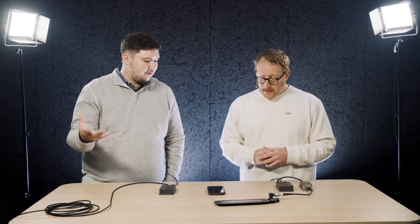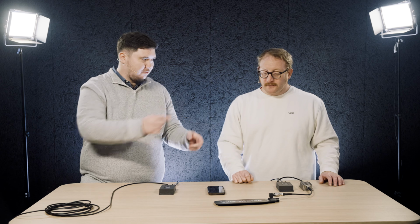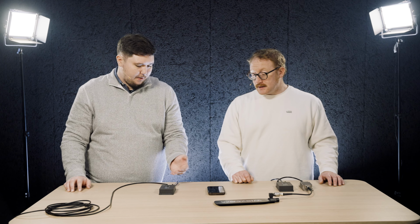So our amplifier, yeah, so it's a shift. When you're in antenna mode, the BFL-T has the booster or bias output voltage. When you're in IFB mode, the BFL-R has the voltage out. And it's all about just keeping note of where your T and your R belong in your application, because it can shift in how you're doing it.